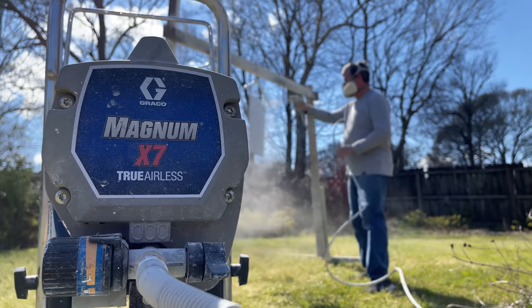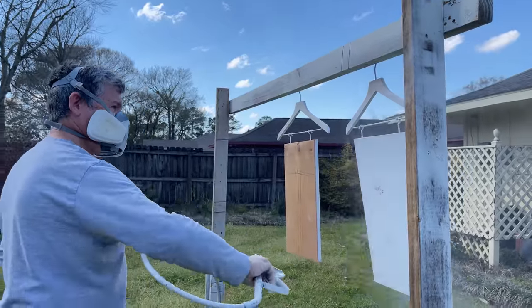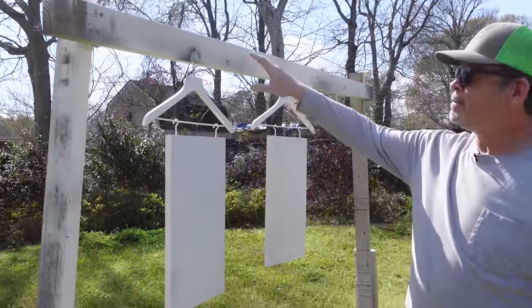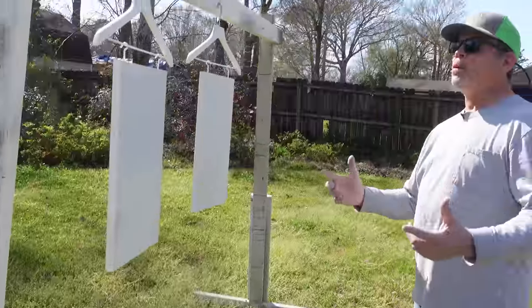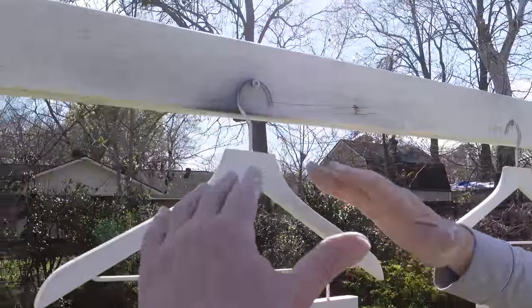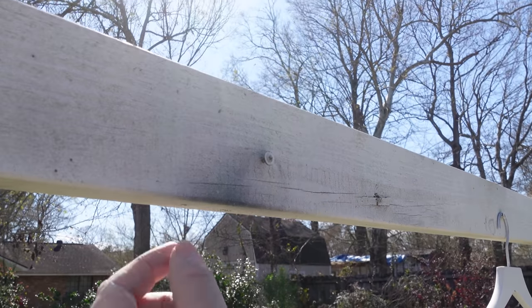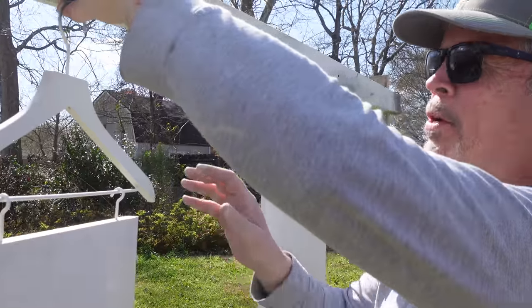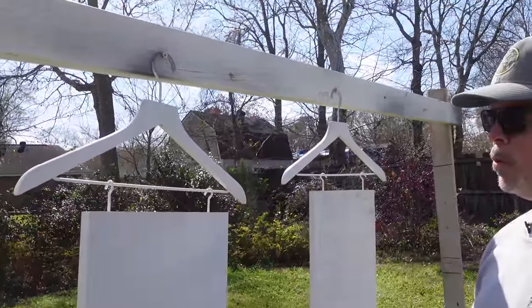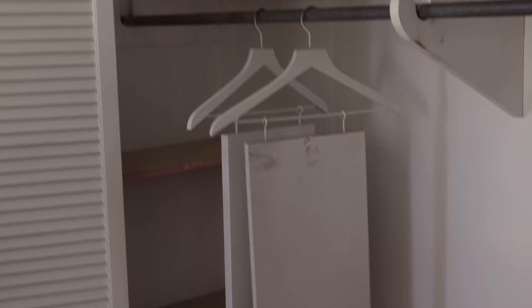That looks sweet! Let's head to the backyard and paint a couple of shelves. Here's our StudPak painting system — how we paint both sides of shelves and doors. It's just two-by-fours and two-by-sixes cobbled together with screws, but it works great. Use a wooden coat hanger — wire ones are too weak and will fold. Strong cup hooks. I put a screw on the face so the piece can't spin when you're spraying or when the wind catches it. And if it's about to rain, I can take them inside, hang them in a closet, and they dry overnight.